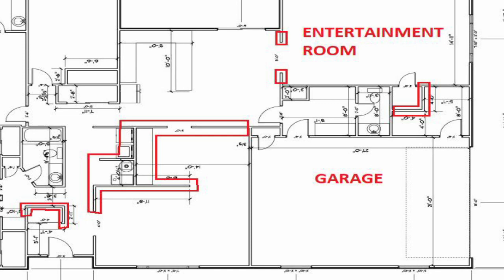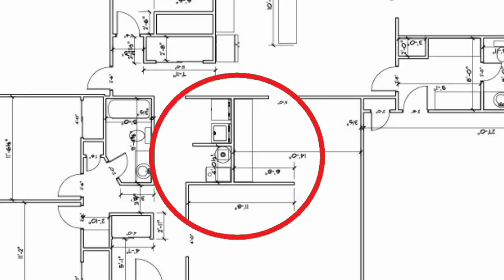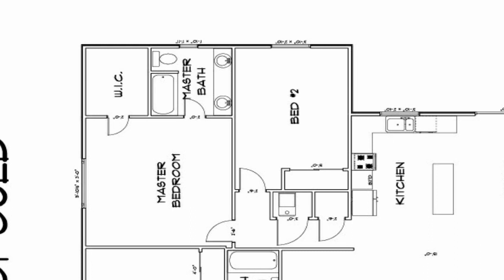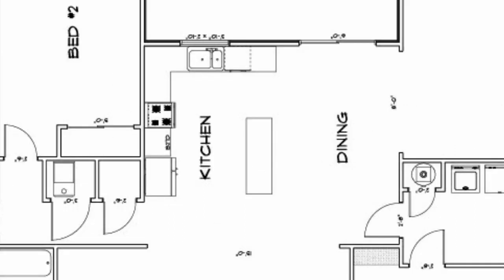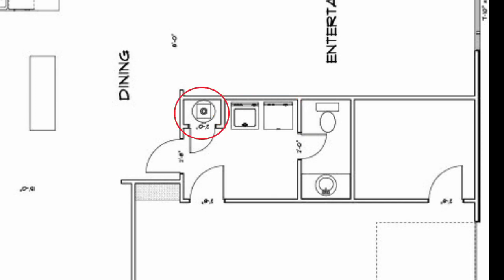Now that we've discussed the walls being removed, we'll go over the rest of the changes. Since we removed the entryway coat closet, the closet around the corner has been turned into the coat closet. A small wall will be framed to distinguish the hallway from the living room. This small closet will be closed off from the hallway but opened into the bathroom to become a linen closet. The bedrooms will remain the same. Now that the washer, dryer, and mechanical closets are gone, this hallway closet is going to be split into a pantry and furnace closet. The master bath will have the tub removed and replaced with a standing shower. In the kitchen, we'll be doing all new cabinets and countertops, and the layout has been changed to have a standalone island. Lastly, the entryway from the garage will have the built-ins torn out and turned into an actual laundry room while housing the water heater. Here's the proposed floor plan — this will create a more modern and open floor plan, which is desired in today's homes.